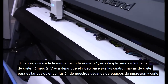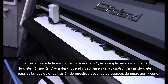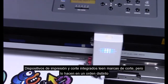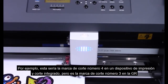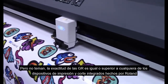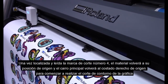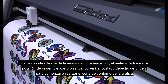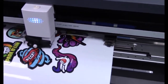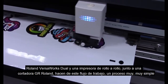Once crop mark number one has been located, we're moving over to crop mark number two. I'm going to allow the video to run through all four crop marks to avoid any confusion from our integrated printer and cutter owners. Integrated print cut devices read crop marks, but they do so in a slightly different order. For example, this would be crop mark number four on an integrated print cut device and is crop mark number three on the GR. The GR's accuracy is equal to or greater than any of the integrated print cut devices made by Roland. Once crop mark number four has been located, the media is going to return to origin in the feed direction and the head carriage is going to return to the far right origin and begin contour cutting our graphics. Roland VersaWorks Dual and a Roland printer paired up with a Roland GR cutter makes this workflow very simple.